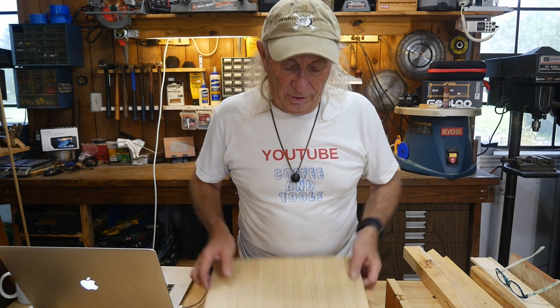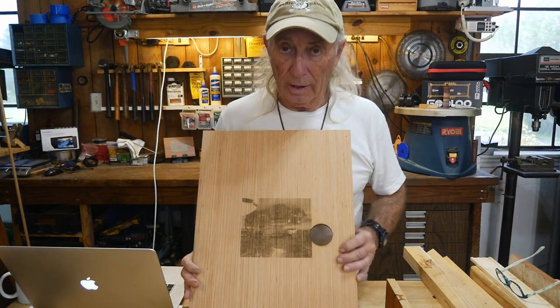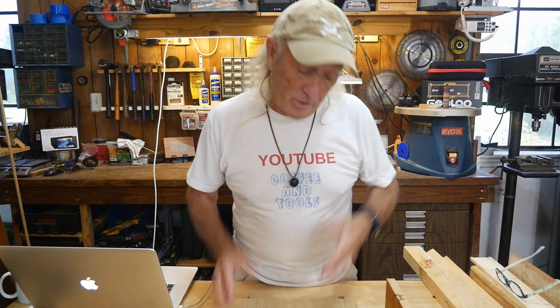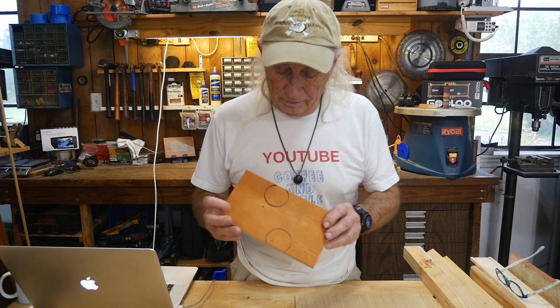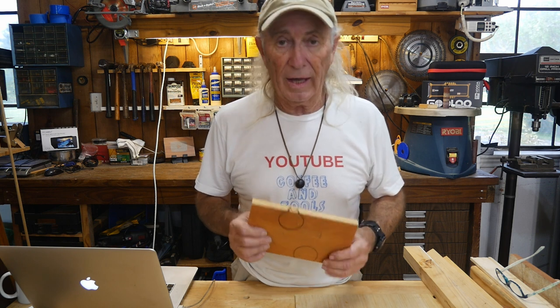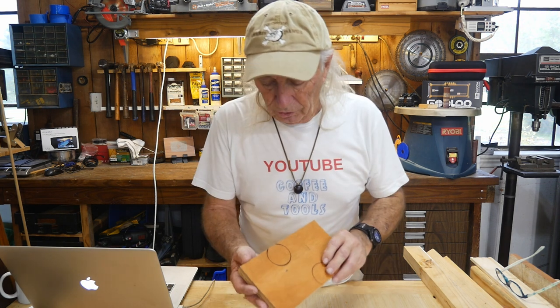The results are in. I can cut a quarter-inch piece of plywood reasonably easily with less than 100 cycles — it will cut a quarter-inch and do a nice job. When we tried the 500-cycle test on the three-quarter-inch board and just let it run and run at 100%, we got down to almost three-eighths of an inch. After that we're running into what I call the 'stupid zone' — you're wasting a lot of time. Granted, a laser cutting something can do tremendous work and beautiful patterns.